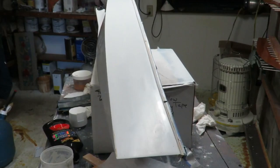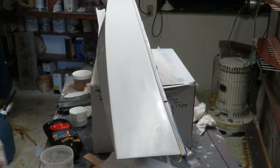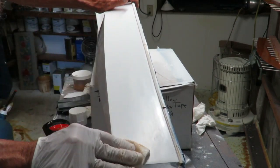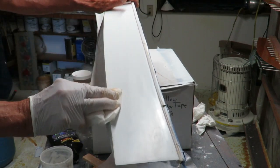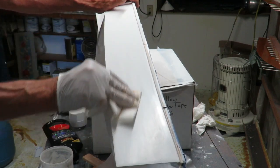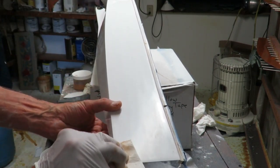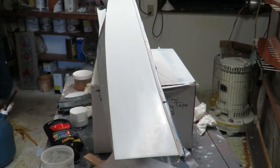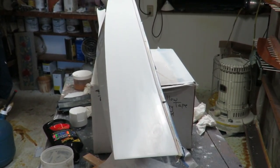Okay, now I just wanted to, we've just done the medium cut cleaner and cleaned it off pretty thoroughly. If that was our ending point, we'd clean it off more thoroughly. But we now have what really would be called a satin finish. It's a gloss, just not a high gloss. And that could be, Carl out in Hawaii prefers a satin finish, and that can be very effective. But we're going to take it two steps farther and go for a high gloss finish on this one. Just partly because it's so much fun polishing it. And partly, yeah, it'll look great with a high gloss finish.